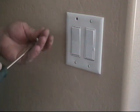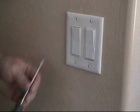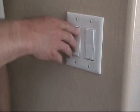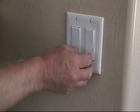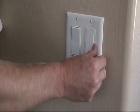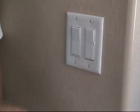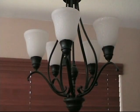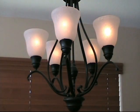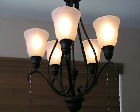We're ready to go — turn on the power and test the circuit. Plate is installed, screws are in. Testing the light switch — it's working. Here's how the new slide dimmer works: there's a little preset level you can adjust for brighter or dimmer, and on/off. You turn it on, bring up the level of the lights, and leave it where you like. When you shut it off it shuts off the fixture. Testing the fixture: turn it on to my preset level — about 50% brightness. You can crank it up to full and bring it down for mood lighting. Perfect — this light was way too bright for dining, so this will be just the desired effect. Off, on — and another job complete.